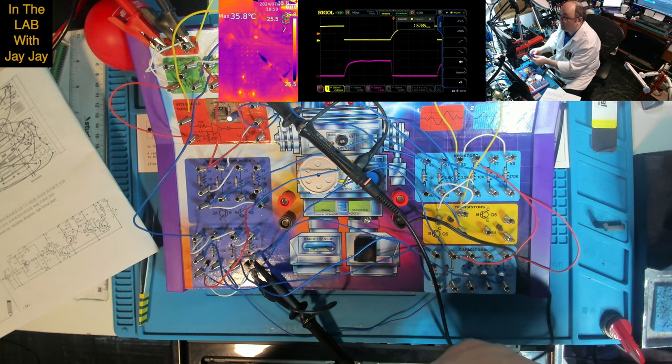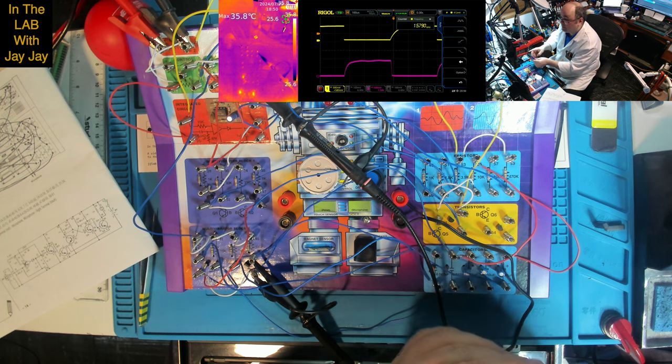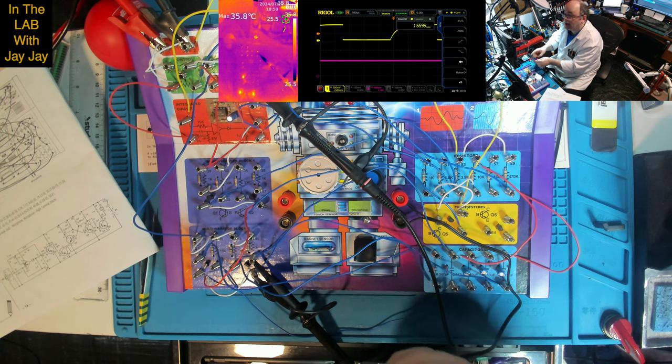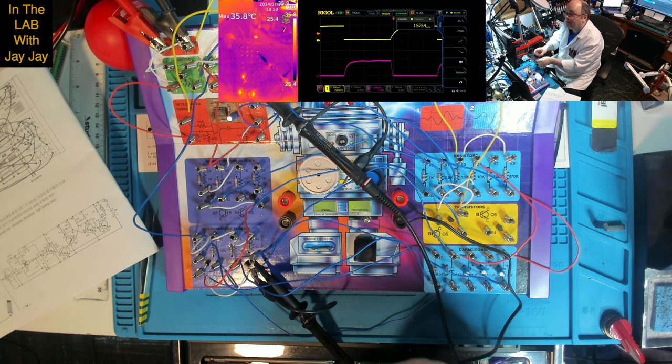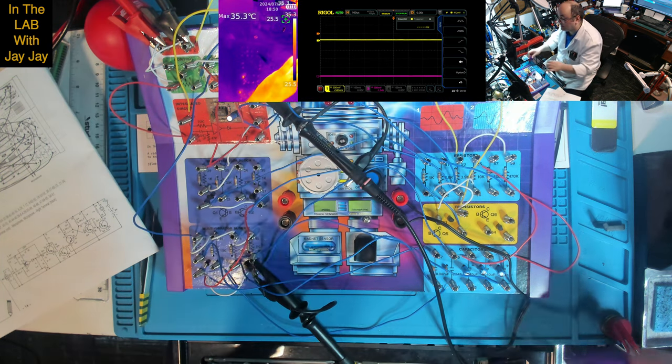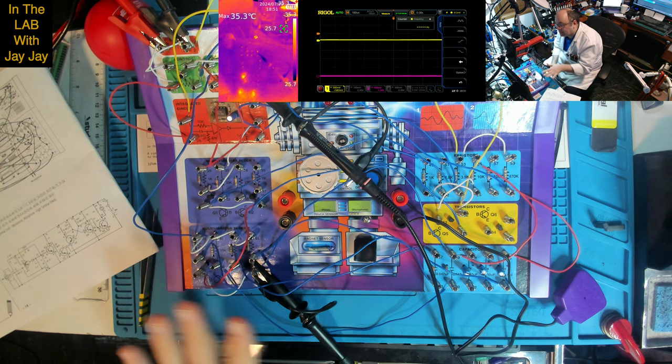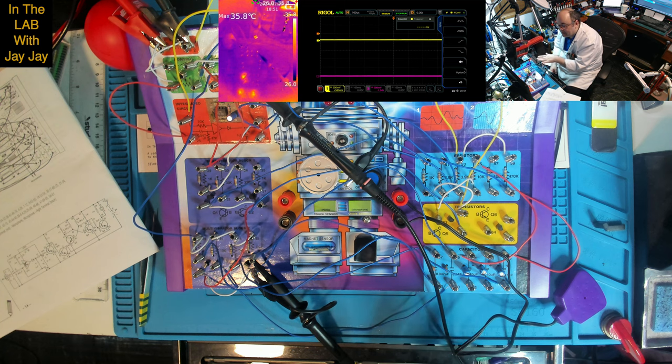Here we are back on the bench, and I'm sorry for the loud wailing, but you see the purple probe on the scope is measuring the sine wave that's actually coming across the buzzer, but the yellow one is actually showing the A-stable multivibrator, and you can see even when we make a big racket on the microphone, which turns off the tone and it goes quiet. You can see it go quiet when the purple flatlines like it is now. But you see that the probe on yellow actually shows you that the A-stable multivibrator just continually flips between states. So it's not that the buzzer really stops. It's just that the buzzer stops getting connected to the speaker, the piezoelectric element.